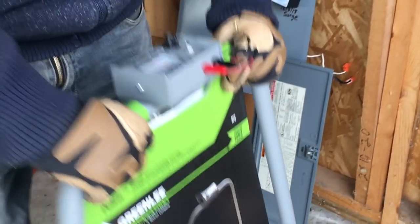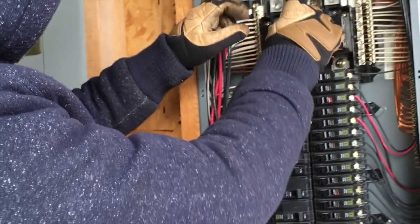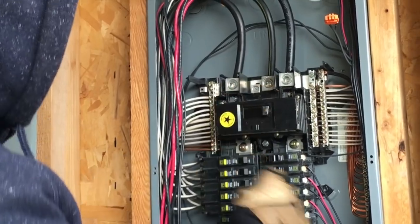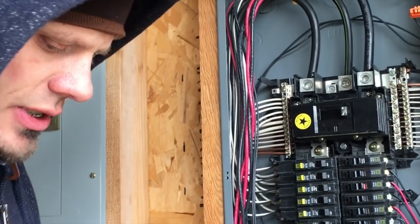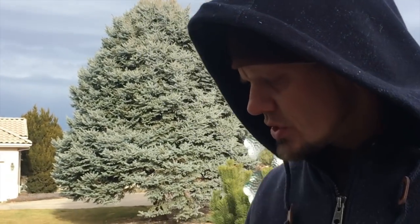This A-frame is a PE2003. It does really well at indicating where underground that wire can be. I have a couple methods. I like to use the clamp on this guy to clamp around and try to figure that out. You never want to hook this up when the leads are hot. Right now this is hot and this is your neutral. You can clamp your neutral there, or kill the power, take the feeders off, make sure they're dead with your multimeter, then clamp it and signal any which way.